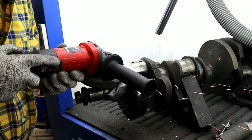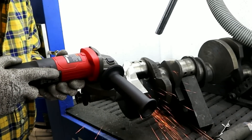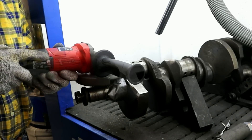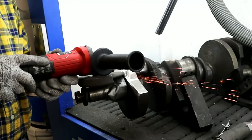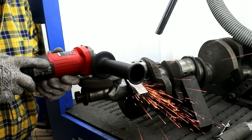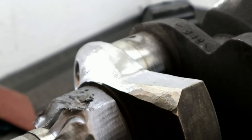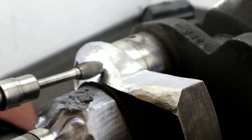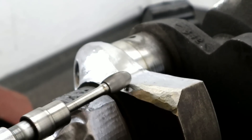It's a case of handling our grinder very carefully and rounding off the depression right next to the area that I indicated with the pointer. This is a tricky job, so do not try and rush it. The chances are you will slip and grind on the bearing journal unless you have an old bearing shell taped up as I described earlier. This is probably the trickiest part of the crank — it requires a really steady hand, but fear of damaging the bearing usually helps you get the skill quickly. Now I'm using the carbide burr here to dress that radius in the area I'm working.